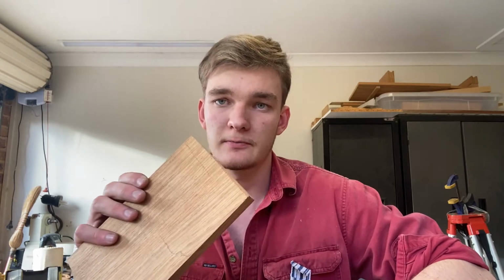What I'm going to do now is just cut out 2 scales from it, drill the holes in it, and epoxy the handle on. I might slightly profile them before I epoxy it on, but that'll be the process, and I think I'll come back to you when it's done, because the hand sharpening is not exactly that exciting or different. I just go with different grit sandpaper, with the sandpaper secured and traveling along by hand. So that's not very different. So chances are next time I see you will be when the knife's finished. So hope you enjoy.